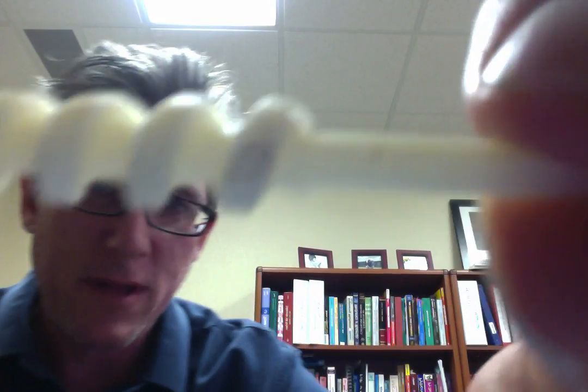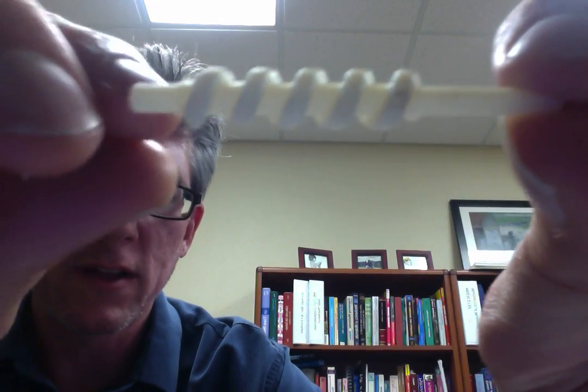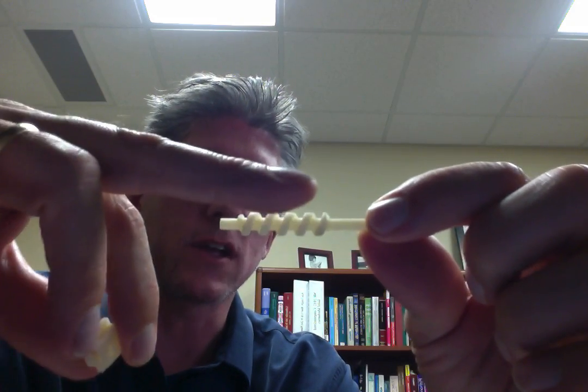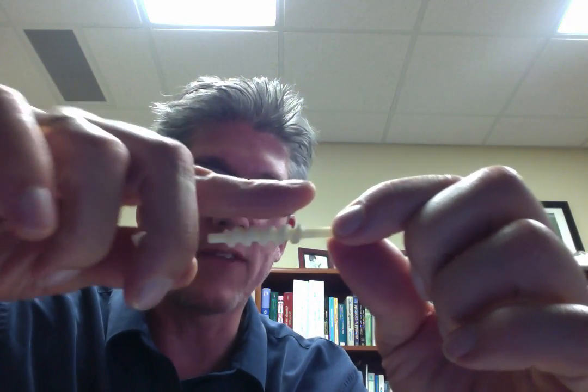And that actually seems to work pretty well. If you look at the parts — these parts were grown in this orientation, so you see the stepping, rastering through this depth here. And what that means is on the tops we kind of have like a flat, and then better rounding on the sides, but a more exaggerated stepping on the top and bottom.